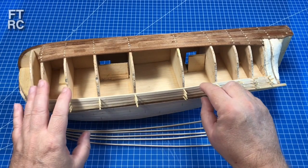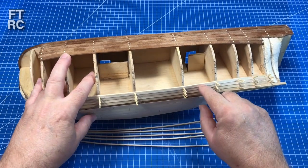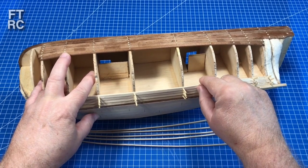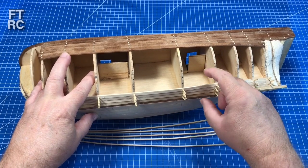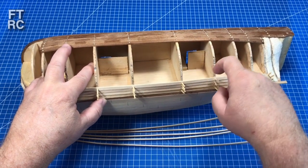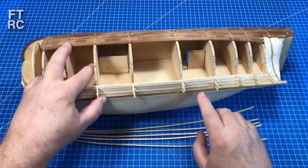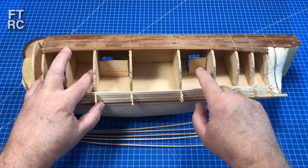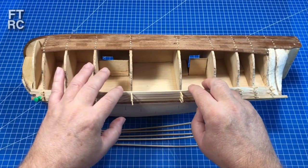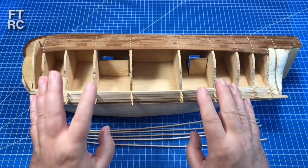When I put the wet-bent birch planks on, they swelled a lot more than the sapele ones did. I should have had nine five-millimeter planks giving me 45 millimetres, allowing one millimetre creepage. But no — I ended up with about two and a half millimeters extra, which means they had crept that much due to the wood expanding and the way they were placed. That's very interesting and proves my point for my method.